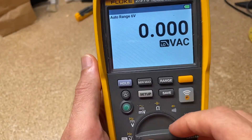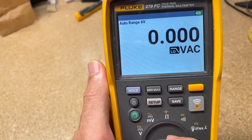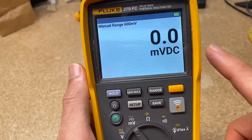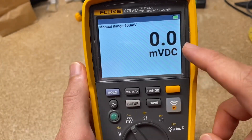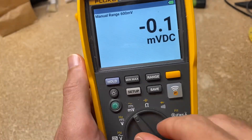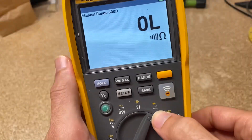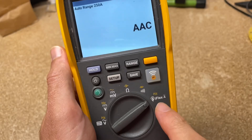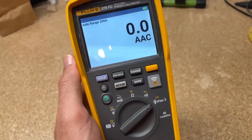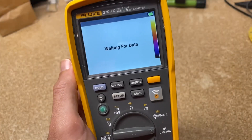Really nice and easy to see — if you just want to use it as a multimeter, it has a great backlit screen. You've got AC voltage, DC voltage, and it has a low pass filter. I've got other videos on that — just go to my YouTube channel and search with the magnifying glass. You get millivolts, then both resistance and capacitance — capacitance by hitting the yellow function key. We've got continuity and diode test, and iFlex, which actually comes with it. That's why it's got this port here, giving you the ability to measure up to 2500 amps AC. And then your IR camera.